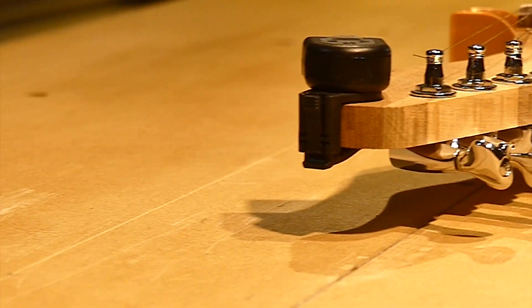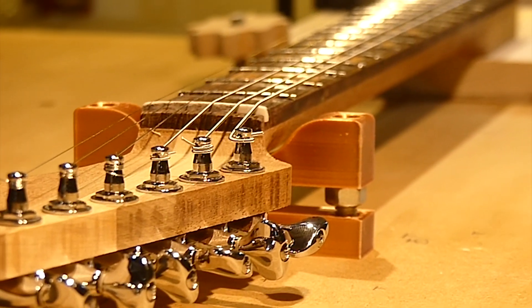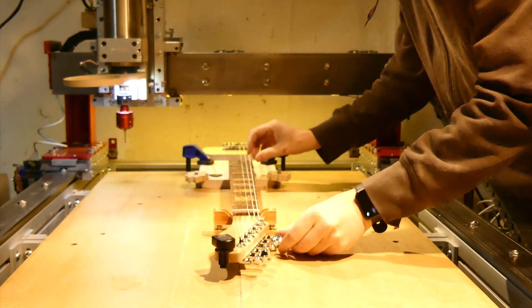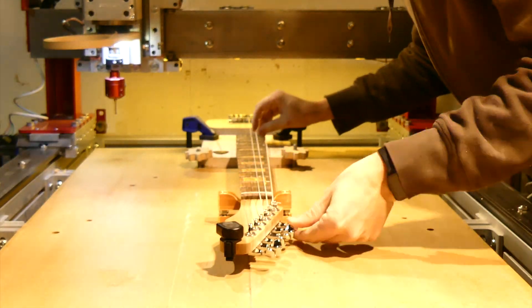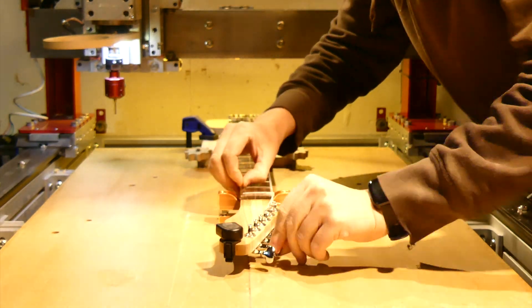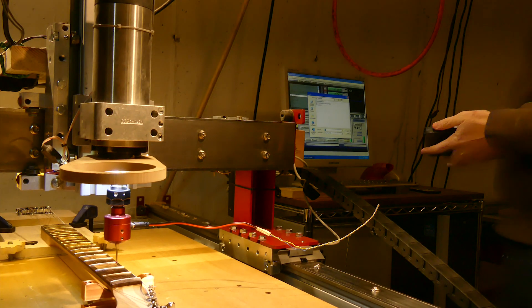I've been making some progress on the fret probing and leveling concept, but there's still a bit further to go until I have something ready to release. I'm using this test rig to probe frets and import the CSV file created by Mach 3 back into Fusion 360. I've worked out most of the details in setting up custom string deflection profiles and comparing them to the probe data. With any luck I'll have some working prototypes soon.